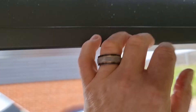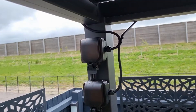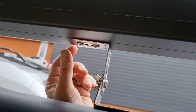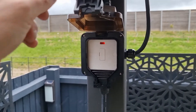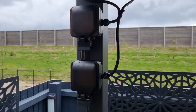When I first came to have a look at the job, I saw straight away it was going to have its challenges because it was made out of metal. Also, these fins turn, and this down here is actually a gully which goes down into the legs — it's part of the rainwater runoff. So I had to be careful; I've fixed to the back of the metal rather than the front, because the front bit is the gully. If I'd drilled into that it would have just leaked everywhere — it was just a little bit of forethought really. And now, the spurs — I'll open that up so you can see inside. Nice and easy. I thought you might be interested to see the thought processes that go on in order to finish the job.